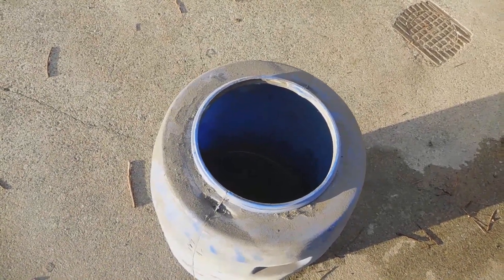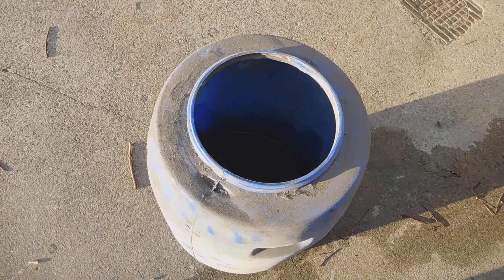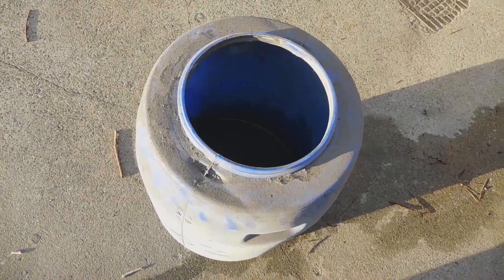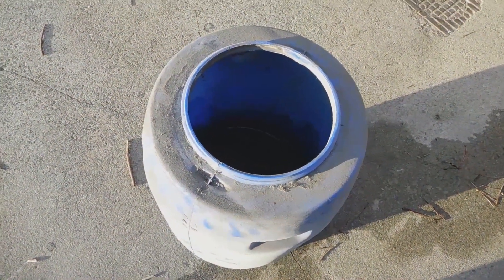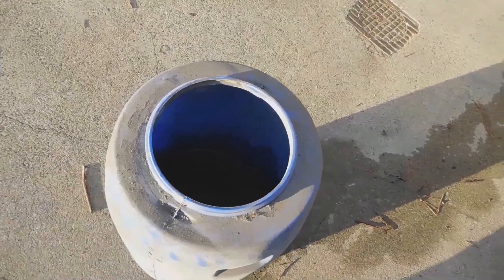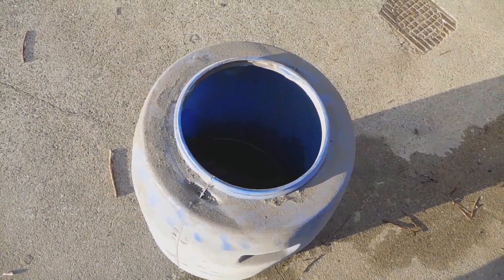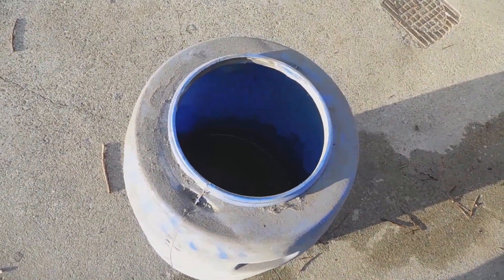That's a key part of sandblasters. If you have a look at a really expensive sandblaster box, you'll see a big chamber behind or underneath it that does pretty much the same function. And if your sandblaster hasn't got that, it's essentially missing a bit. But you can make it out of cheap PVC tube, stormwater tube, glue it together. You don't have to spend a whole heap of money to have a sandblaster with that feature that separates the fine from the coarse. At the end of it, we're not losing any media out of the cabinet, and the dust is slowly building up in this. We only have to open it up every year or two and scoop the muck out, put some water back in, screw it back on, and away we go again. We don't get any blockups in the pickup tube of the sandblaster because all the fine dust has gone from inside it.